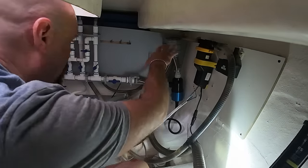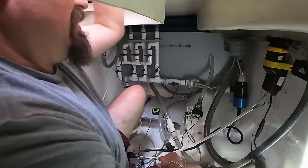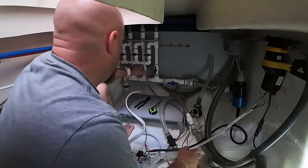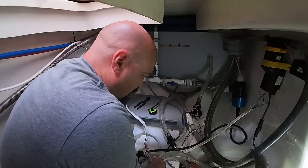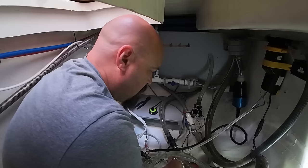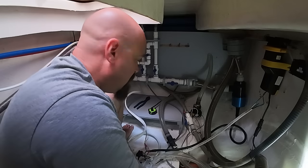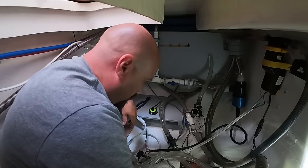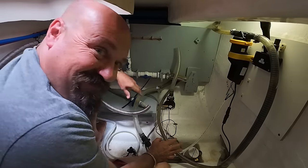I'm going to leave all the water in here. Over here on the edge of the manifold I put a drain in originally for servicing purposes, and look at that — it's coming in handy. Let's drain the system. Sludge — that's going to stink. Man, there is a lot of debris in that system, just draining it into the bilge. This big black sediment came out. I think we definitely need to barnacle-bust this as well. Hoses are disconnected and all the seawater's been spilled. Now I'm going to pull this panel out.